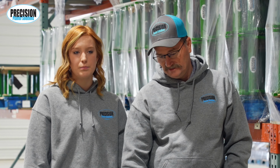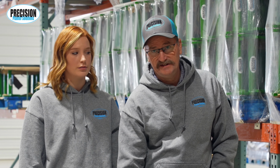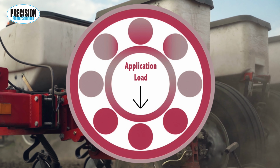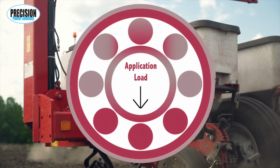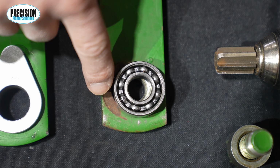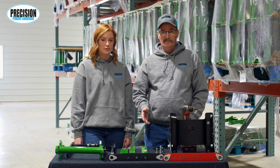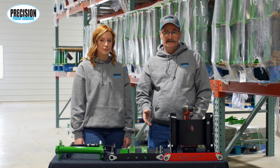This is one reason bearings are not the best choice for your parallel arms. This just isn't the right application for a small ball bearing that would have 3 less than 1/4 inch balls trying to handle all of this pressure. The limited rotation of parallel arms means those 3 little balls are eventually going to be carrying all that load without any grease. You also just can't check the bearings and make sure they're going to make it through planting season. A bearing will fail and then need to be replaced immediately, most likely at a time you should be planting.